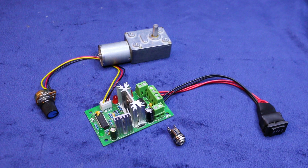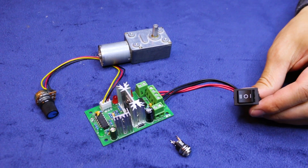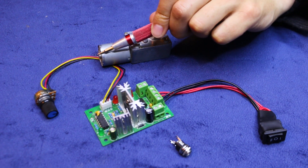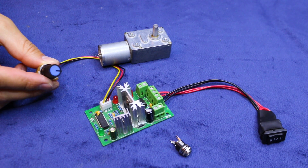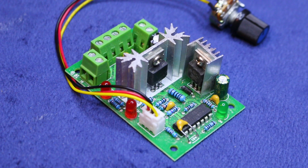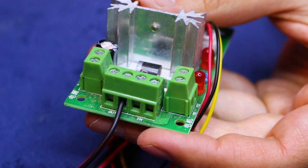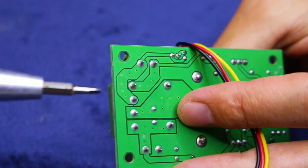I need to hook up the electronics — links to all the components can be found in the description below. I've got to connect a power connector, there's a switch which will control which way the motor turns, I have a high-torque geared DC motor which will connect here, and there's a potentiometer already connected to the control board for changing the speed. Max-rated speed of the motor, by the way, is 30 rpm. Now the board is much bigger than I thought it would be, so let's get rid of some of its parts. I certainly don't need any of the LEDs. These connectors are used to easily attach wires to the board — I can throw them away and solder the wires straight to the board.